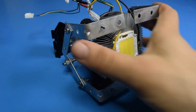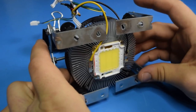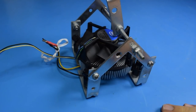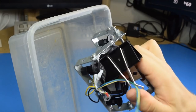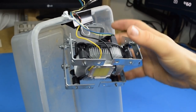Since I had to deal with this large fan, I ended up using the board mounts as part of the construction of a frame that holds it to my desk. These are 75 millimeters apart, which didn't matter for this but does matter for the future. I was able to just go to local hardware stores and get some stock metal parts to create a reasonably usable frame. I have shelving built on top of my desk, so I designed these with a binder clip with a hole drilled through it connected to that, so I can just clip it onto the bottom of the shelves and have it be fully positionable.